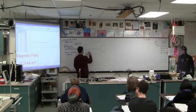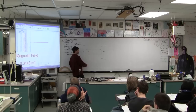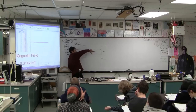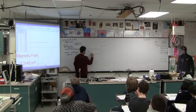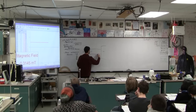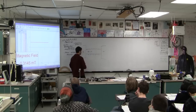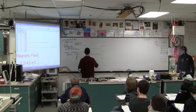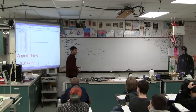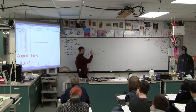And if you think about it, a positive charge moving this way — if a positive charge were to move that way, what's going to happen? Well, it's moving to the right. The force is going to be which way on it? Down the page. So this thing is actually going to drift down the page, and the bottom is going to be positive, and the top will be negative. All we have to do is take a voltmeter and hook one side here and the other side here, and we'll read this side as being the positive side, this side as the negative side. The stronger the magnetic field, the stronger that voltage difference is, and we can measure it.